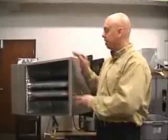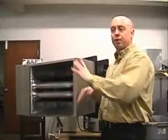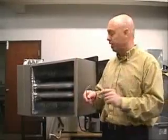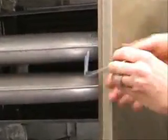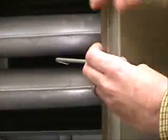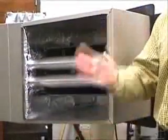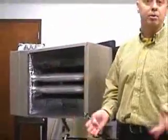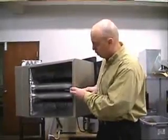A lot of guys will say: on many applications you have a case coil sitting directly on top of the furnace. Although I set this up as a testing area with separation between the coil and the furnace outlet, I realize that is not always the case. When you run into those cases, one good place to get the reading between the coil and the furnace is the backside of the furnace. I can tap the back of the furnace up at the top area and get the probe in like this, so the probe sits there. You don't want to be on the sides because there are typically baffles that run all the way up the side of the furnace — they keep heat on the outside chambers of the heat exchanger and can give false readings. But as long as you stay close to the top and don't drill in too far, you can easily tap the back of the furnace and get your static probe in there.